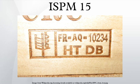or ecosystems. ISPM 15 affects all wood packaging material, requiring that they be debarked and then heat-treated or fumigated with methyl bromide and stamped or branded with a mark of compliance. This mark of compliance is colloquially known as the wheat stamp. Products exempt from the ISPM 15 are made from alternative material, like paper, plastic or wood panel products.